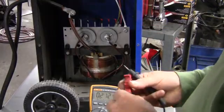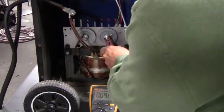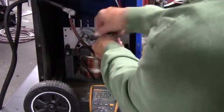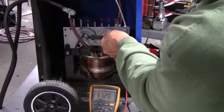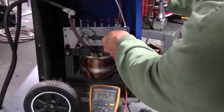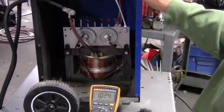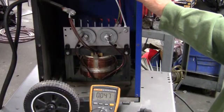What we're going to do is take our Fluke meter, put it to AC volts, and we're going to test the AC output right here from the transformer. I don't know if you can see that meter, but we're reading 26 volts. As I change the rate switch, that voltage should change — now we have 31, and on high we have 34. If I go down to 6 low, we get 20 volts. So that test tells us that the unit is working and that the transformer is putting out AC to the rectifier plate.